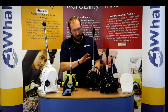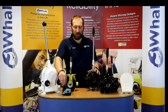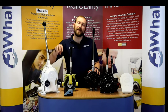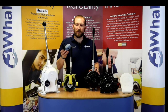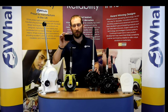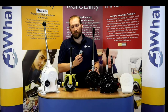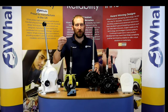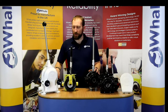Before I start talking about all of these pumps, one of the things we should always remember is that if you're installing a manual bilge pump, you should always have a little strum box attached to the inlet that sits right in the bottom of your bilge. The strum box has a non-return valve in it, but it also has a filter on the bottom. The filter is about 10 millimeters, meaning anything larger than that won't be sucked up, but it also means that your hose doesn't buckle under the suction. So always install one of those in the bottom of your boat.